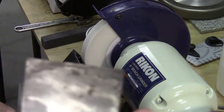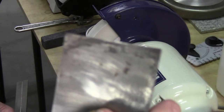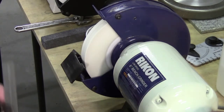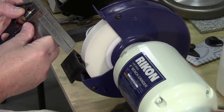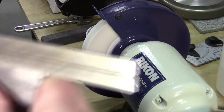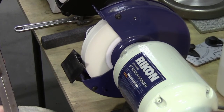The back of the blade is pretty well pitted too, so this is not going to be one of my best blades ever. I'll work on that at the bench with the diamond plate, and if I have to tap it out I'll tap it out — with a soft face hammer actually. Right now in just those few seconds I'm a lot closer to being square and the nick is almost gone.